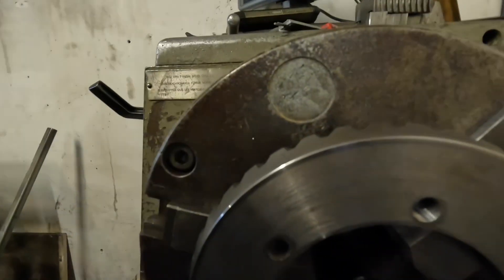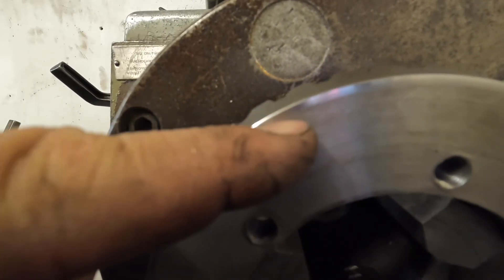The other job I started the other day — I took three mil off a crown wheel for a customer. He's dummy built it and I've got to take another two mil off. I didn't film the first bit but I'm filming this second bit. You can see where it's polished around the stud holes — that's where it's hardened. That bit is a bugger to get past. The actual steel part once you're past the hardening is okay, but the hardening is rock hard. I have to keep doing little bites at it.